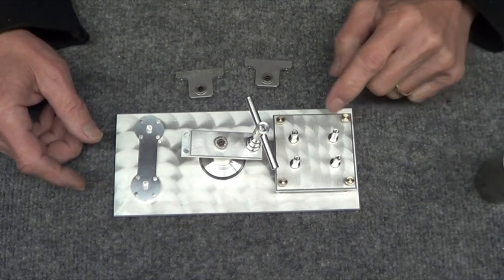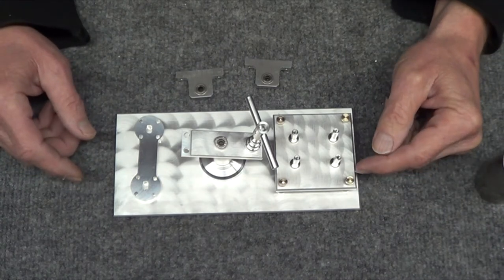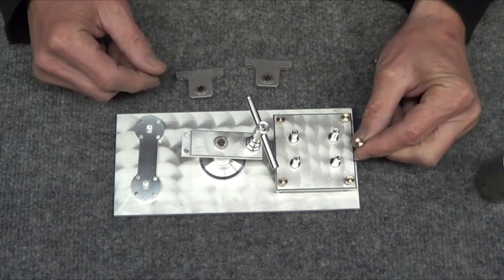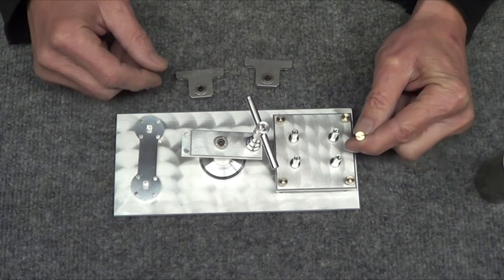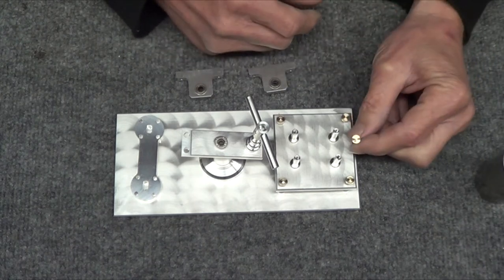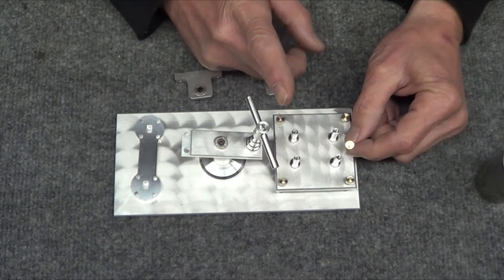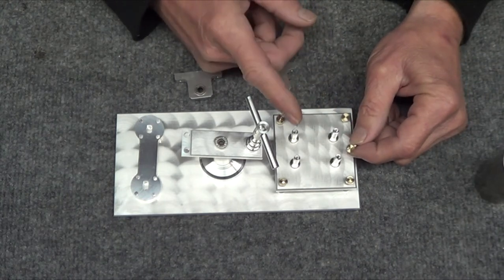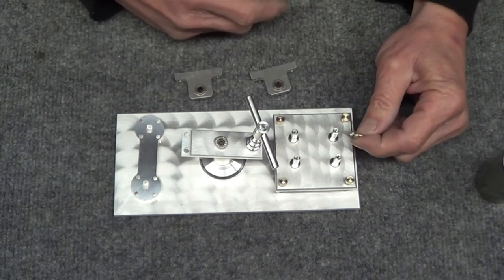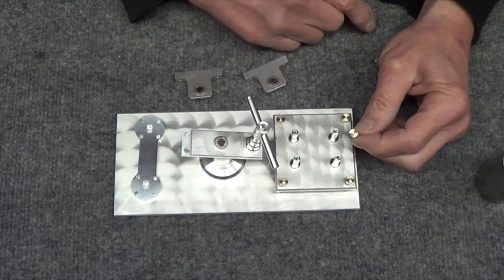I did show making these guys, and I wasn't too clear in that video, in the opening of it, that this is the test piece that I was playing with, and I came down and it rotated in the thread protector. But the issue was on the mill, it's such a small bit, you can't feel when it really touches, you can't feel the forces, because the mini mill head is so big. So it's real easy to break a bit, and I need to go even smaller. So that was the issue.